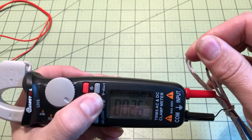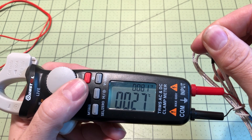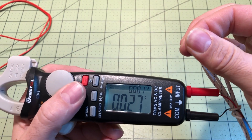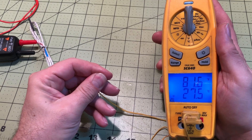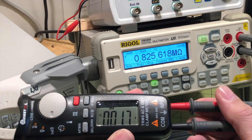For temperature accuracy, I got about 82 degrees when I pinched the thermocouple with my fingers. I tested it against my Field Piece and it came out really close — pretty much the same temperature. That was one of the reasons I bought this unit.